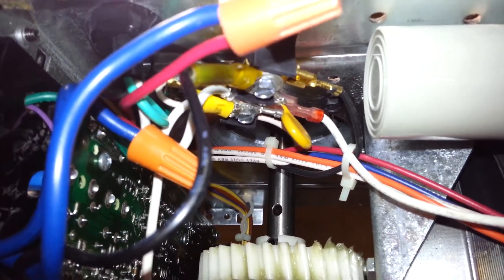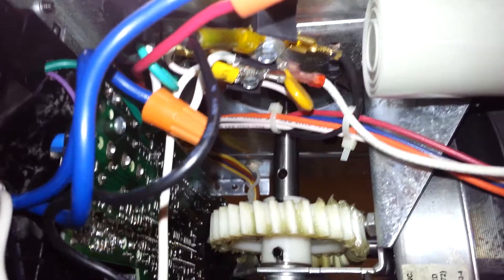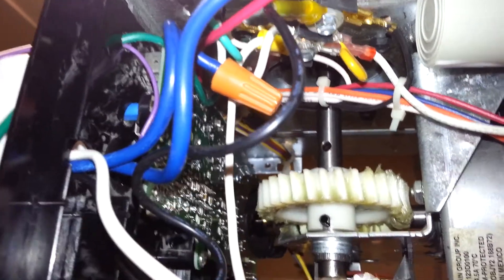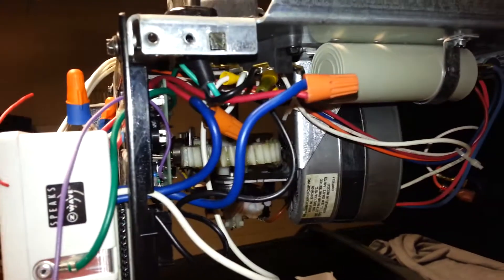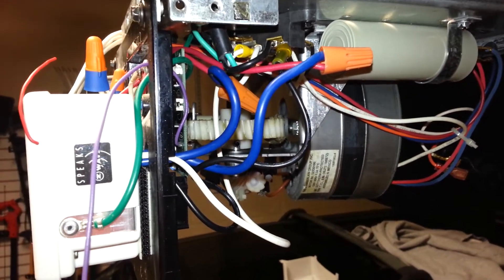Mine is just plugged into a regular 120-volt outlet, and what I did is I just matched up the white and the black wires for your load and line, and also your ground wire which connects to the ground and the chassis of the unit itself. Then I just drilled a hole in the back of the unit and connected my LFM20 to those. The two blue wires are obviously going to the triggered output that you're using from your wall control, and I went ahead and connected those on the back.